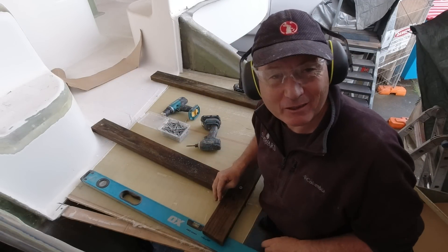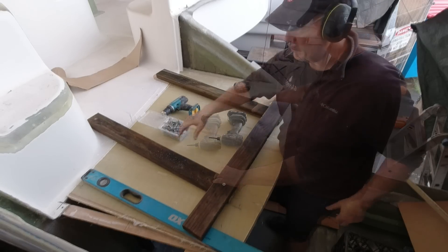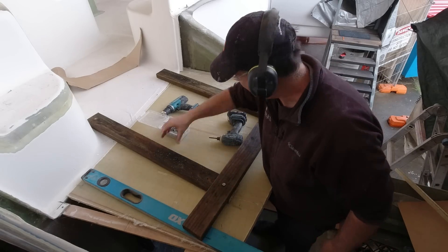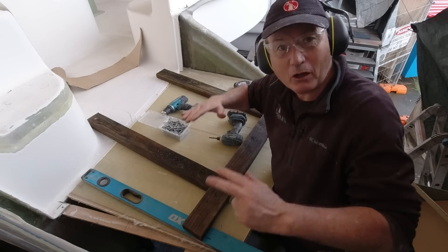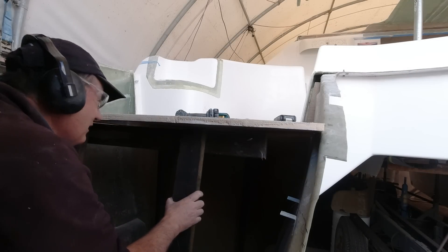I don't want to have something in there that I'd have to cut out with a chainsaw. I'm also going to use this as the upright for the next stair, so I'll put a batten across there on the other side to hold the bottom stair. I'm going to be able to drop through the hatch that I'm going to cut out and dismantle this whole thing, but that's now giving me a solid base for that stair. I'll drill a couple of holes through it to hold it in place — and at least my top stair is now secure.